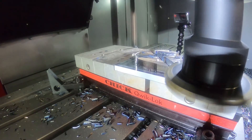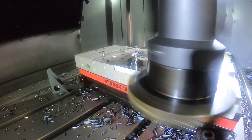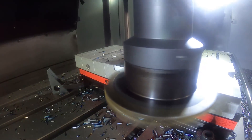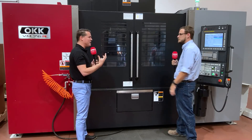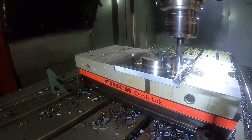The seven-inch key cutter with a 200 thou step over is doing a full one-inch depth of cut. Holy cow — you can hear the noise. It looks pristine; it sounds like there's vibration but there's none, it's just the slow RPM — only 700 RPMs. You're hearing that thing actually smack against the metal.